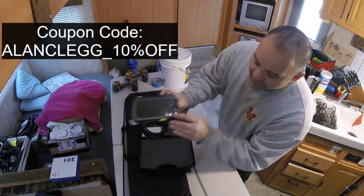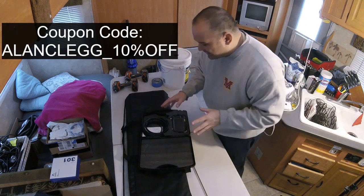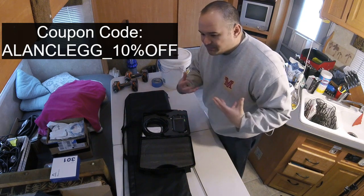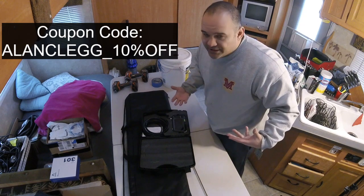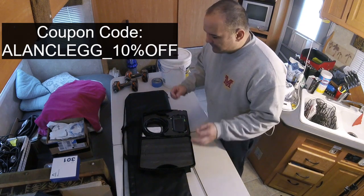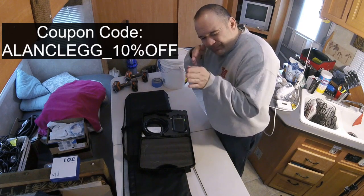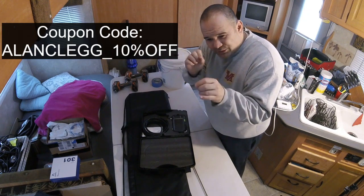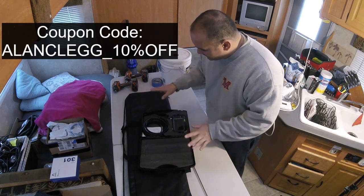I'm using the NTS 500. I'm using this one because I don't like the scopes that pair to your phone. I don't want things pairing to my phone. I don't want to worry about extra batteries. I don't want to pull my phone out on an installation; I'm afraid I'll drop it, put a tool on it, or get it scratched, damaged, or dusty. There's also a little bit of a delay, and I don't like the delay, because sometimes I'm using the scope on one side and somebody's using a glow rod on the other, and I'm giving them instructions. I want everything in real time, live.